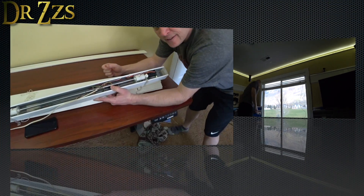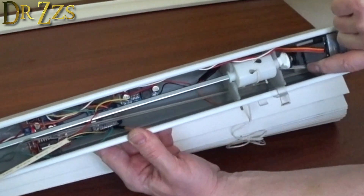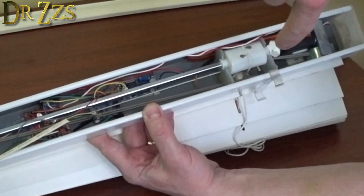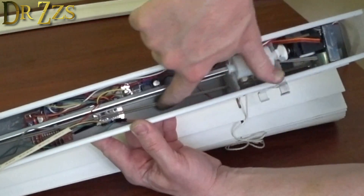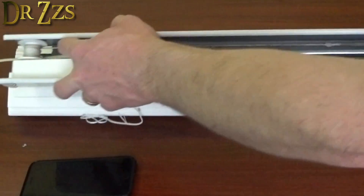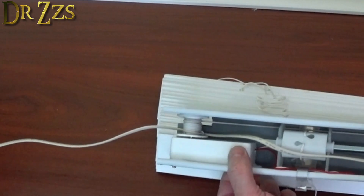It's demo time. Let's walk through what's going on in here because it's a lot of stuff. These two cords right here are the two that pull up the blinds — this is the one that goes to that side and pulls up that side, and then the other one goes right below this barrel. They go into this pulley, which is the old tilt mechanism pulley, and then they go around here, through, right on top of these guys. Then over here they become one string — they're tied together, become one string, keep on going, and then end up on the pulley. This ended up being the 10 RPM motor. Even the 24 RPM motor wasn't strong enough to lift these blinds — these are pretty heavy.